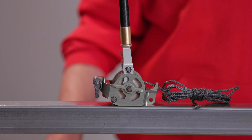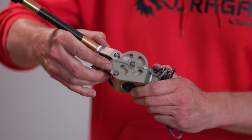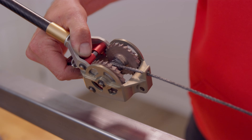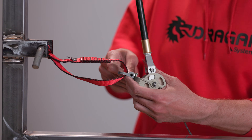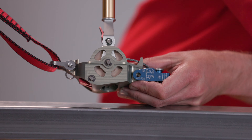Start by prepping the line. Rotate the crank to disengage the crank pawl. Disengage the frame pawl. Unspool the line, leaving about three wraps on the spool. Then attach your gear. Use the shackle to anchor the pocket winch. This time, attach the Capio to the winch body.